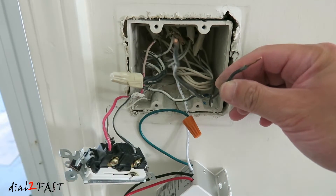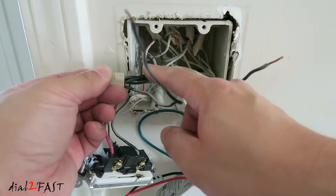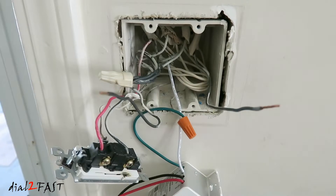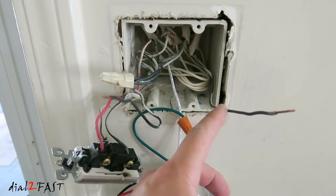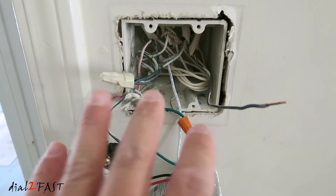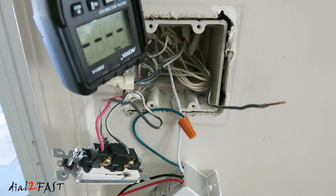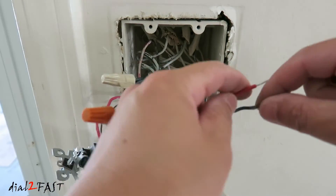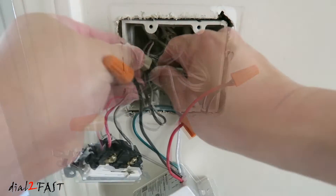If you look at the box right here, we have two black wires, and it might be a little confusing. What you want to do is follow the wire and see where it's going. This black wire goes to this bundle right here, so this is going to be your supply side with the voltage coming in. This other black wire is on its own and goes up to the top which goes to the light fixture. Depending on the wiring you have in your home, it might be more difficult to identify which wire is coming in and which is going out. In that situation, you can get a voltage tester with a non-contact voltage tester, and before you remove the old switch with the breaker still on, put the tester on the input wire and then on the output wire, and you'll see which one is live. Here I'll connect the black wire from the dimmer switch onto the live wire. Connect the red wire to the black wire that goes to the light fixture. At this point all the wires are connected, and I'm going to push these wires back in.